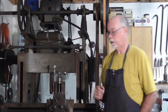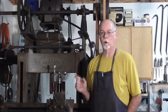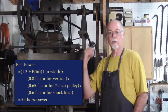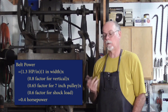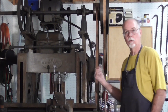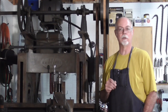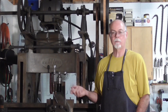From that, I look up the table and find the belt should transmit about 1.3 horsepower per inch — and it's a 1-inch wide belt, so 1.3 horsepower. Multiplying all those factors together, the power the belt will transmit without slipping comes out to around four tenths of a horsepower. The numbers aren't exact to four decimal places, but there's pretty good agreement between the cut requirement and the belt slip calculation.